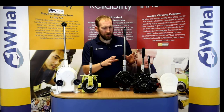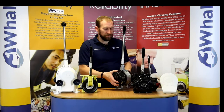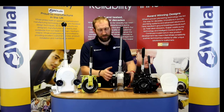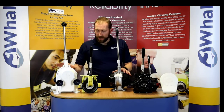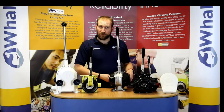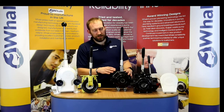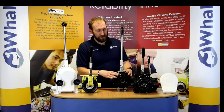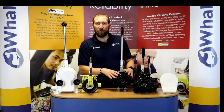We'll move on to our composite pumps. All of them are plastic with the exception of the double-acting Mark V, which has an aluminum center. As you can see, you've got two ports here and two ports here. Much like the GUSHER 30, it pumps on both actions, but you have two inlets and two outlets. This pump gives you a really superior flow and is typically used on boats that are quite large — anything over 30 feet. The handle is removable and there's also a version available on deck and through deck.